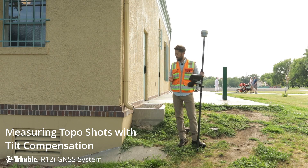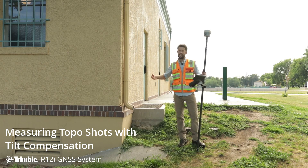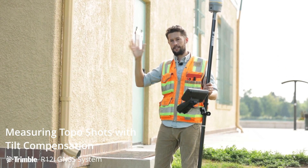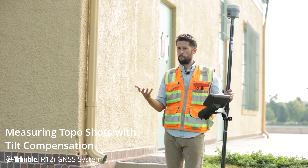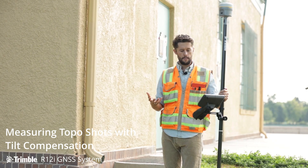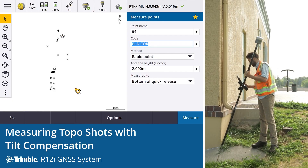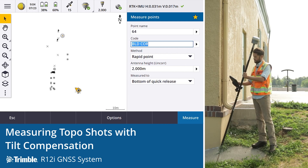Another really good example of something that's been difficult, if not impossible to pick up in the past, is a building corner — particularly with a GNSS system. It's inaccessible, we can't get level over the building corner, and with a tall building nearby we have no access to satellites, so getting a position is difficult. With the pro point engine we're able to get those positions far better than before, and with the tilt we can get in to get that building corner. All we're concentrating on here is the position of the tip of the rod — we can see that our residuals are good and we can take a shot. That easy.